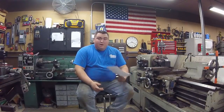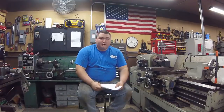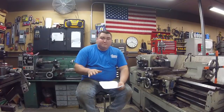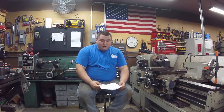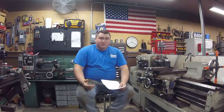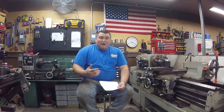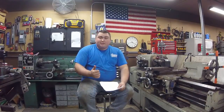Alright guys, we've made it to the end of the video. A couple of special things at the end: one, give away the indicator, and two, I wanted to read through some of your comments. One guy asked what kind of speeds you want to set a metal-cutting bandsaw for — somewhere between 175 to 250 surface feet per minute is what we aim for. The next comment was how to get new customers. There's no really right answer, but the main thing is to get your name out to the industry — do some door knocking, do some sales. Always be consistent with your work to keep the customer, and always produce quality work.